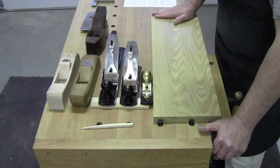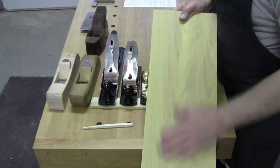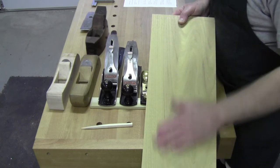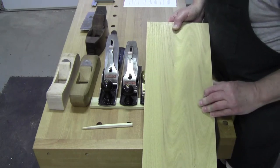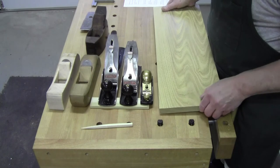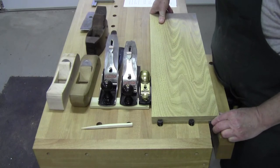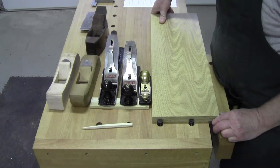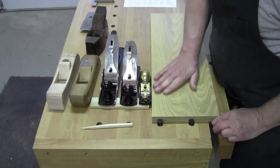This piece happens to be a good size. I may try to make something out of it like a box lid, I'm not even sure. It's a greenish to yellowish color when you first cut it. If you're cutting it down with a chainsaw you will actually see sparks fly. And if you use it in a wood stove, do yourself a favor, be safe and mix it with softer woods. Because if you load a wood stove up with locust and or Osage orange, you run the risk of a chimney fire and turning your wood stove cherry red. Don't ask me why I know this but I know it first hand.